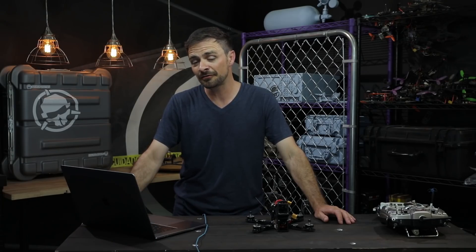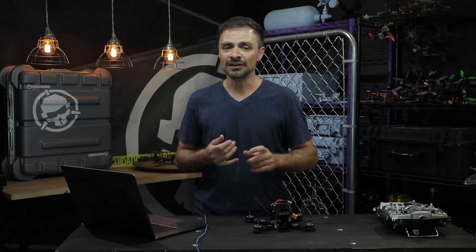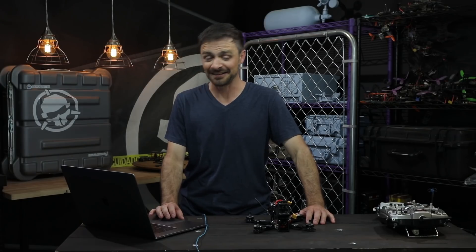It has a standard microphone with an AGC amplifier — similar to the Steel PDB but with a more updated microphone, very low noise. For people who fly with sound it works absolutely perfectly. It does all the normal camera control, whether you're using newer Runcam digital stuff, older Runcam analog, or Foxeer — you can do all your camera control via the OSD. For VTX control you've got power change on arming, boot in pit mode which you can disable, and it supports Lua script on KISS.